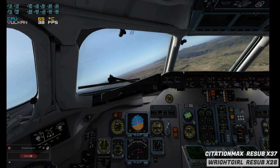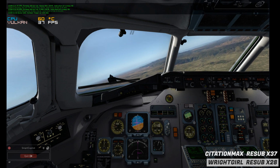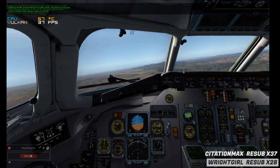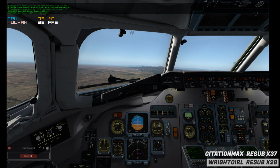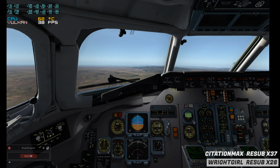Captain Tom, we have the intermediate pressure and the high pressure on the Airbus. So basically, once you're at full thrust, you don't need the high pressure for the bleed and the air conditioning and all of that. So it's only on the intermediate because there's enough pressure. But once you go on low idle, it will automatically open that high pressure valve to supply more air up in pneumatic. Exactly, which is pretty much what all of them do. It uses a pressure switch, right? So when the duct senses lower pressure, if it needs it, it'll turn on the high pressure bleed valve. And of course, it's all automatic.